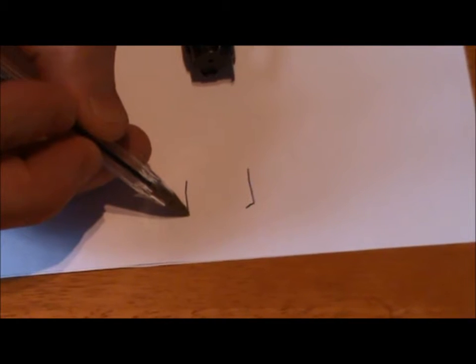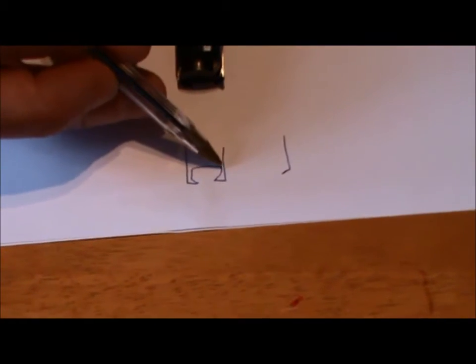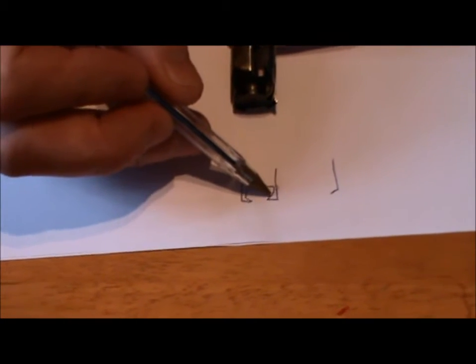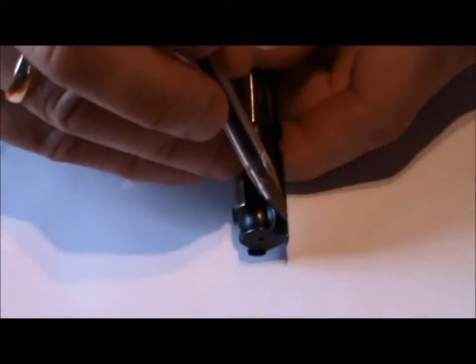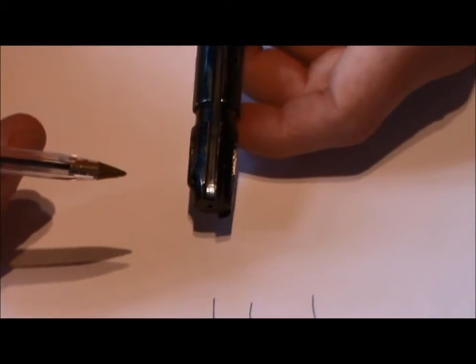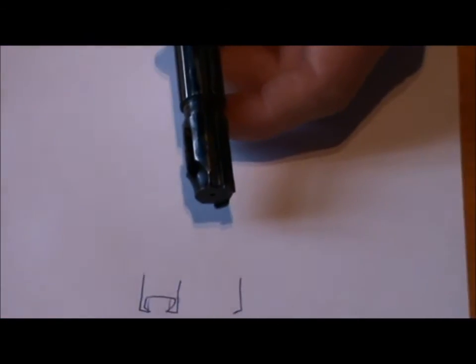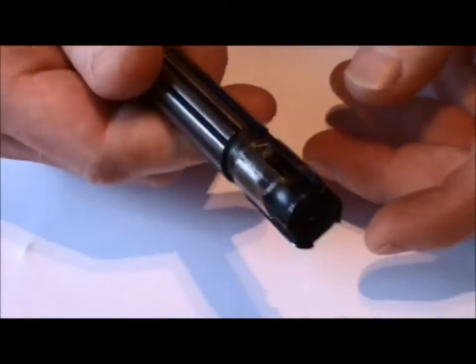When we started, I mentioned there is a little bulk here I was going to file - I didn't do that. The bolt, from above, was very thin here. I assume it's supposed to be like this, but I think the casting is not within spec - it's hair-thin, almost nothing. So when I banged it back and forth or whatever happened, it cracked. I say it's not me, I want a new bolt - it's a warranty claim. You can be my judge. Anyway, it's gone - can't use it anymore.